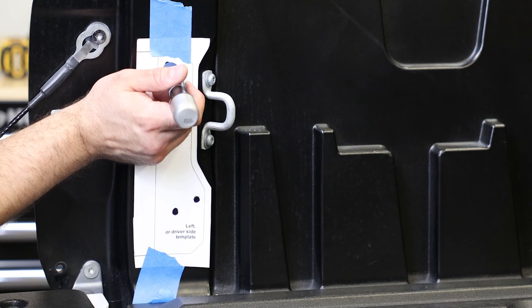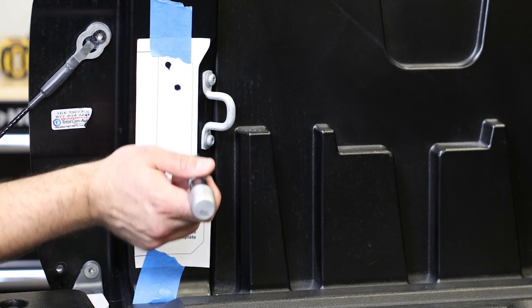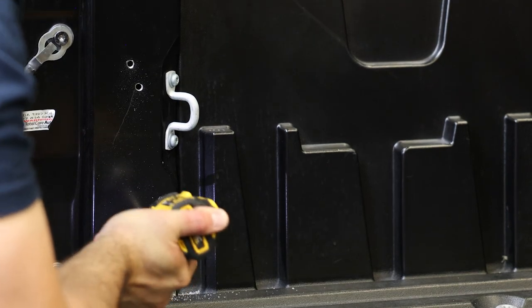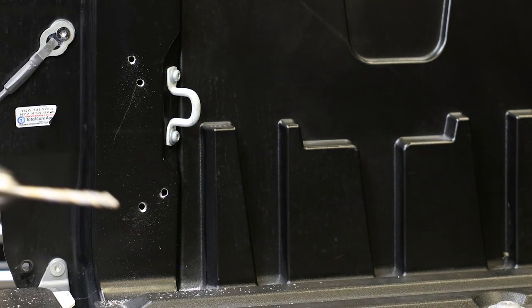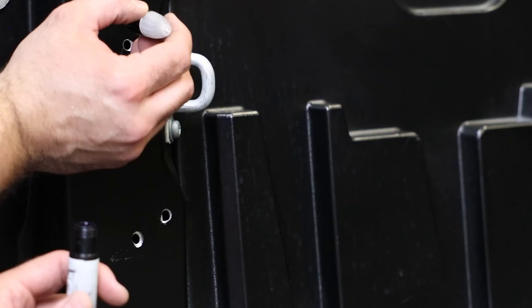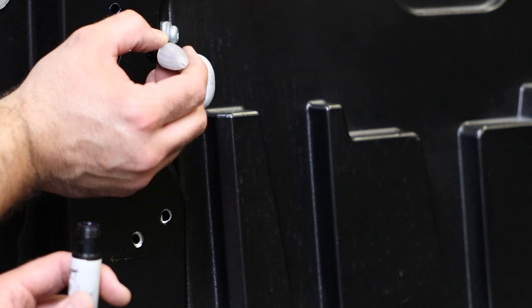I will show my workaround as I already drilled the holes in the next few steps. I'll go through and drill small pilot holes, followed by four 17/64-inch holes in each circle location. The drill should not go any deeper than one inch. Then I'll go through and add some paint to prevent any rust in the future.